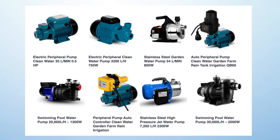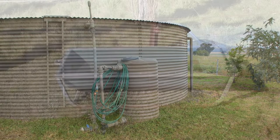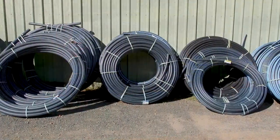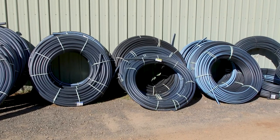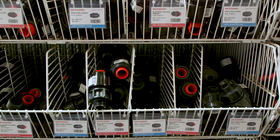There are many pumps on the market and they're not very expensive. If you get the right one for the job it will serve you really well and work efficiently. The pipework that reticulates the water from the dam, pump, or tank to the stock is often considered unimportant, but it does matter. Firstly, you've got to have the right pressure rating — if you buy a cheaper pipe it might not have the right pressure rating and could fail.